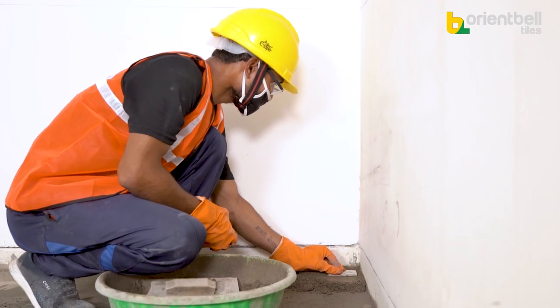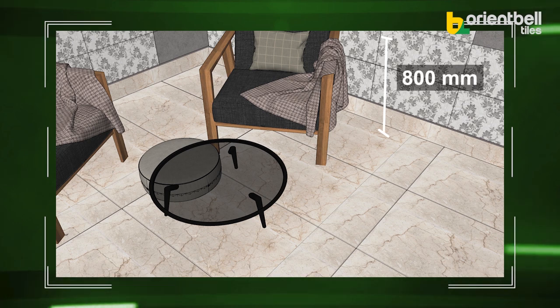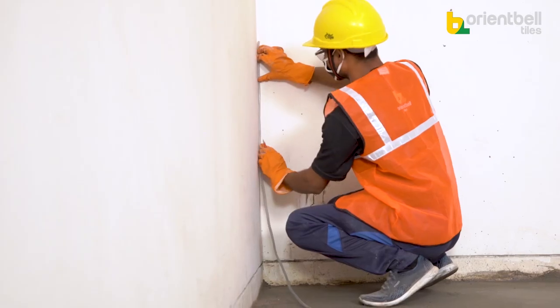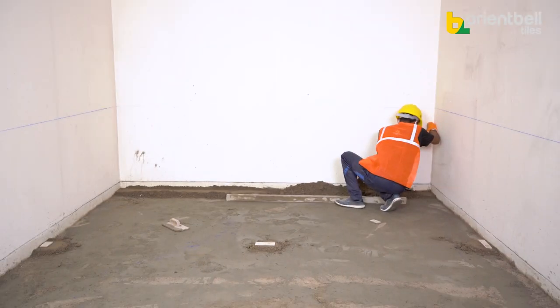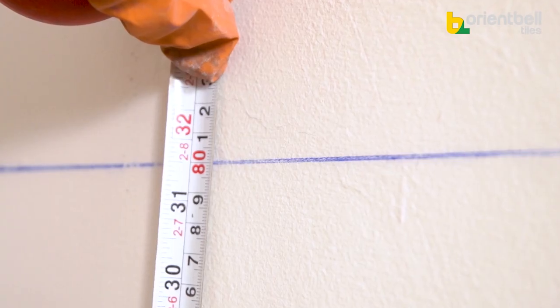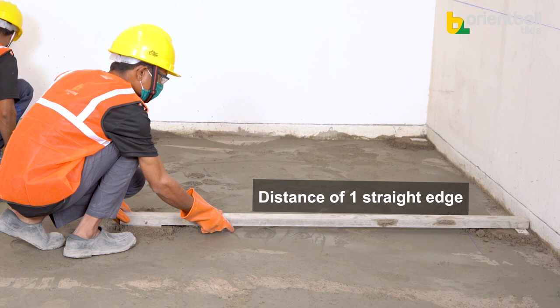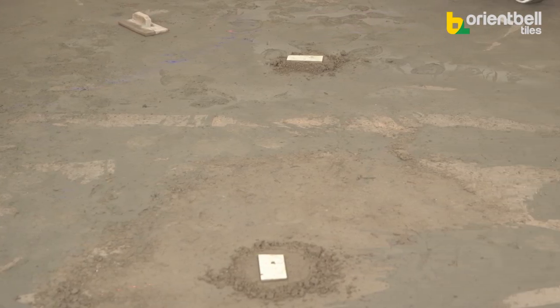For tiling, the surface needs to maintain a uniform level, so level pads are installed to measure variation in levels. The given distance from floor to wall is 800mm. At this level, put marks at different places around the room — the distance from the level pads to each marking should be 800mm. Connect all markings with a line thread. The distance between one level pad and another should be less than the length of a straight edge. Install level pads at different places across the room.